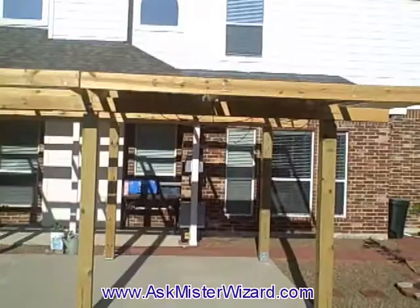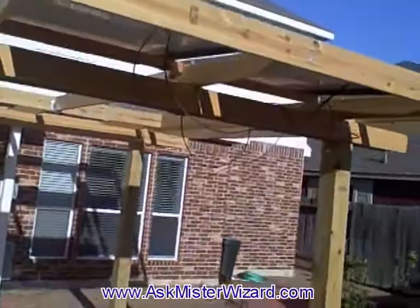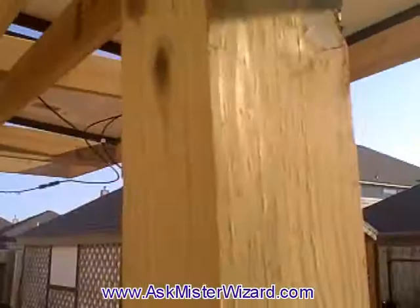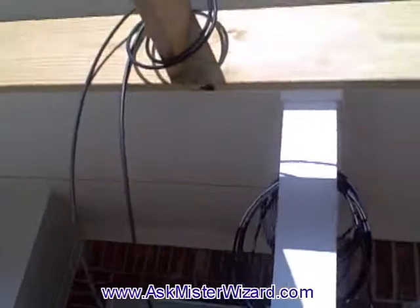That'll finish it. Half an hour later, I have installed the very last wire. You can see this rat's nest of wires leading from the solar panels. I had the negative one in place before, and now I've added the positive wire, routed similar to the negative one across the pavilion, down through these coils, and into the fuse switch right there. It goes through that fuse and up into my charge controller.